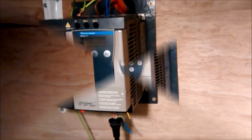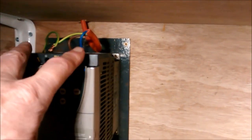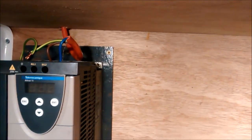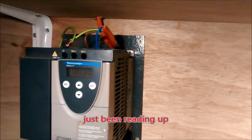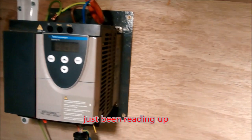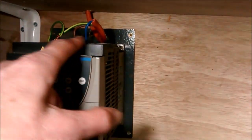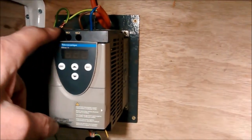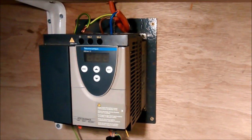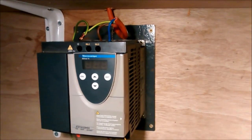It seems to be that often these devices have a filter, a mains filter, because they're generating, I mean this one, a discrete, proper screened cable, properly terminated to reduce the interference from the high frequency side. And if they've got a mains filter on the input side here, then the leakage through that mains filter is enough to trip your RCD. So one solution is to use them without an RCD,